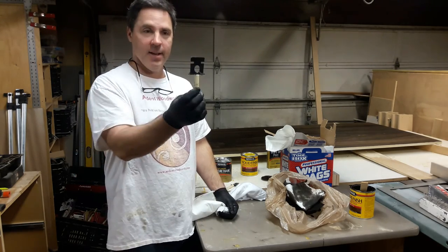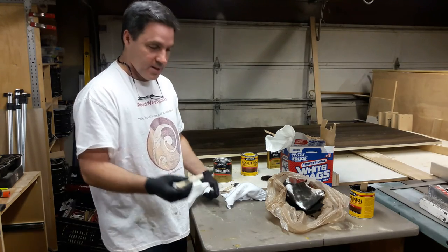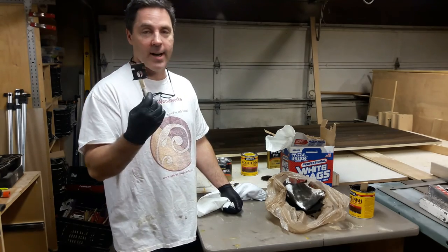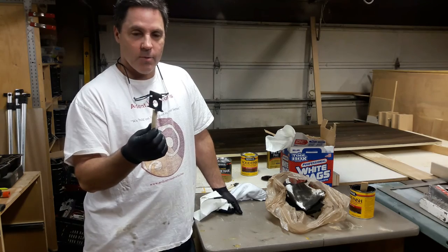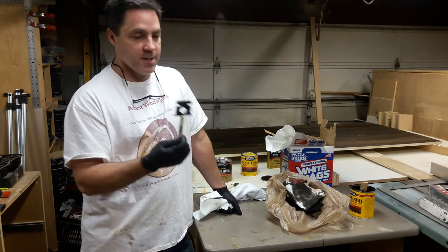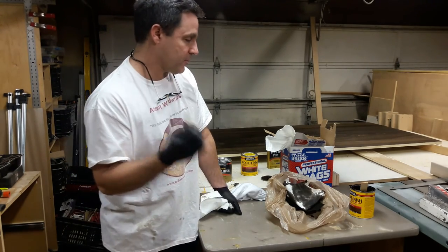All of a sudden you have a glue spreader, and I use glue spreaders a ton especially when I'm making anything paneled. You can just spread your glue out and use this to spread it around whatever project you're working on. So if you're a thrifty person and you want to give your sponge brushes a second life, just tear the foam off and you've got some glue spreaders.